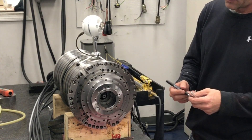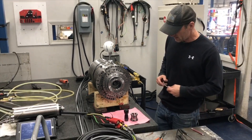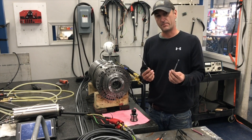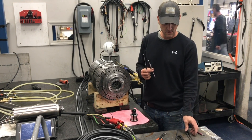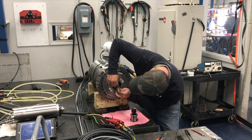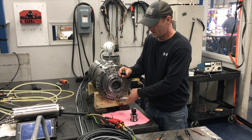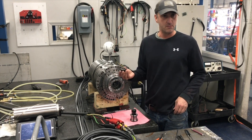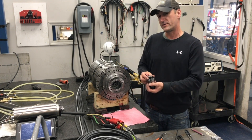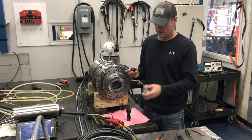The installation is exactly reversed, except there's one more part of this gripper assembly that hasn't been taken out yet. To do this particular job I'm going to need a couple of O-ring hook picks or magnets — I like to use magnets. I'm going to go in there and retrieve this piece — it's a pretty important part. It sets the angles on the back side of these gripper fingers, which help give you the pull force. It goes on the back side like this. When reassembling the gripper assembly, you must put this piece in first, or else it won't go in if the gripper fingers are already in there.